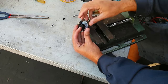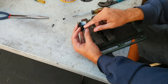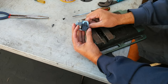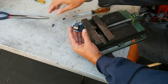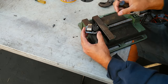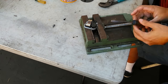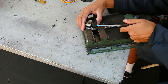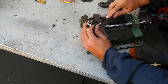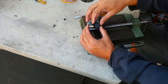If you wind it and the spring is anchored, the spring is going to be able to wind. If it's not anchored, it's just going to keep rolling around in there and never stop. I've got to catch the tab that was there originally and get it to anchor, then I can wind the spring effectively. I got it to register in the hole — see that little piece? Once I got it to do that, it snapped right back together, and I was able to push this part back over the anchor.